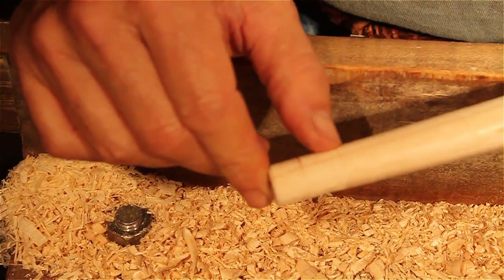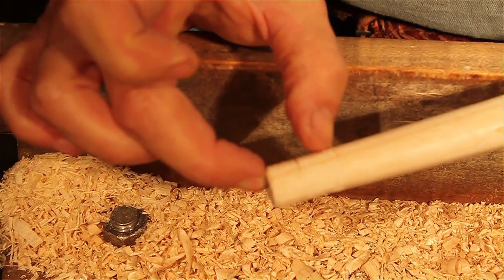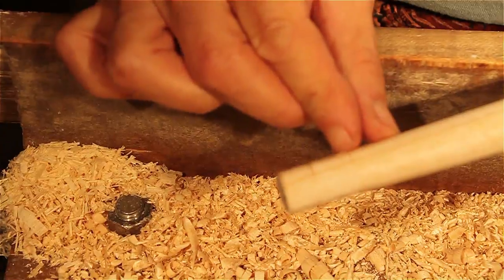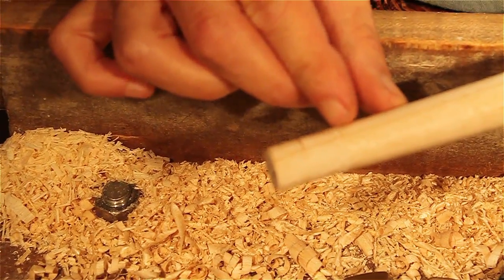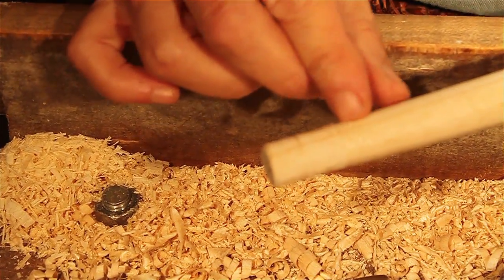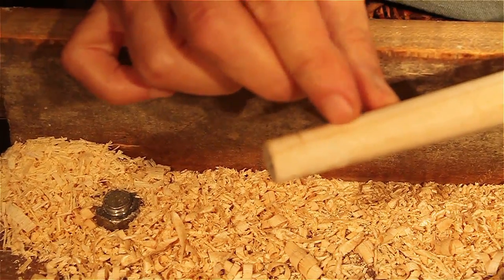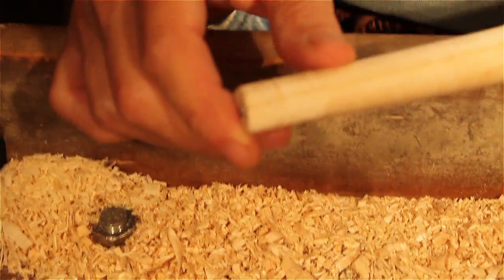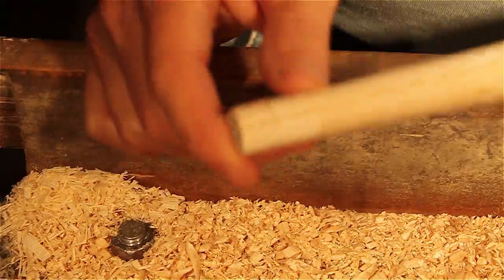This tenon is only an inch long but my mortise is an inch and an eighth, so the stretcher behind the raw tenon will be housed completely inside the mortise — you won't see any raw tenon. If you have a shoulder you end up with a small triangle of raw tenon visible on the chair. It doesn't hurt anything, I just decided to get rid of that. That's the way I do it.